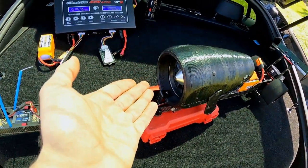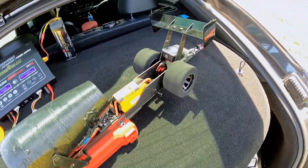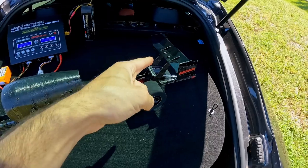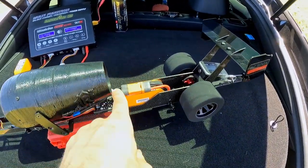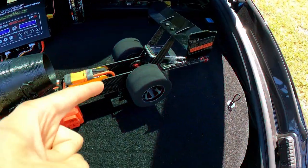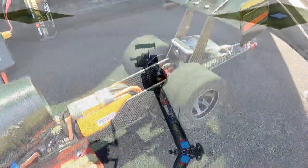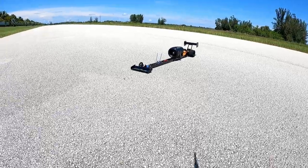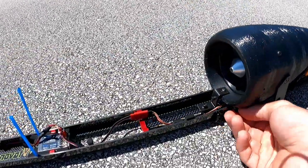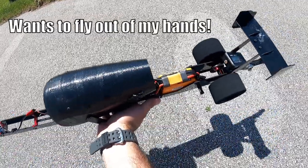We don't want the battery up front — if anything happens, it's going into the EDF, and we don't want that. As for the back, it is a solid axle because this is really a drag car — a rail car in the RC world. We kept the front splitter for front downforce and the rear wing on to stay as stable as possible. Since it's 100% thrust powered, there's no individual axle connection — wheels spin freely with almost no rolling resistance. You can see I'm not touching anything and the EDF isn't spinning — it just wants to roll, super smooth. Alright, we're going to power her up. Battery's plugged in. Switches on. Racers, start your engines.